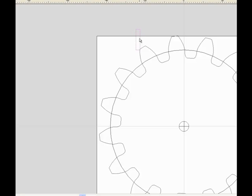You'll notice throughout this that I never move the tool up or down. I simply move it back and forth and rotate the gear to match the tool. This is all part of the mathematics of the involute curve. We are guaranteed to get a nice tangential fit, provided I never move the tool up or down from its location. I follow its base curve to the left by the amount of the unwound string, while rotating in the opposite direction by the amount of angular relationship, and this will always generate the proper positions for a tangential shave.